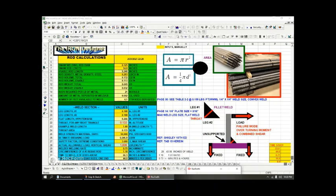It's a rod of metal covered in some kind of potassium cellulose covering that basically evaporates when you're welding it and shields the weld so the weld doesn't get contaminated from oxygen and oxidize and corrode before it has a chance to reach room temperature. So that's the purpose of the shielding.